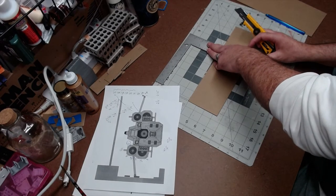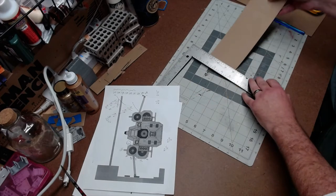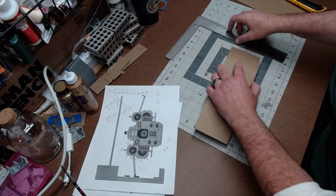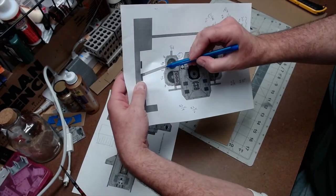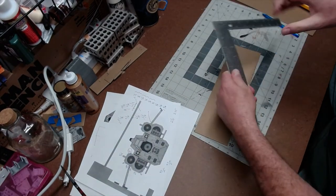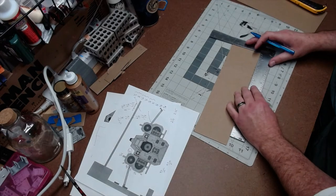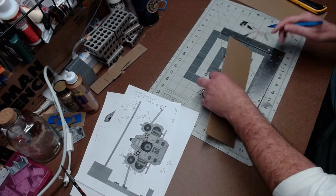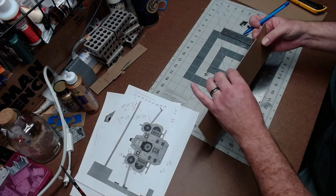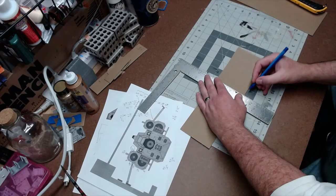Three passes is about all I'm willing to do because I do not want to cut through it. If you do cut through it, not a big deal — you can repair it with a piece of tape on one side. You can see all my cuts and you can start seeing where I'm going with this. Now the next one I'm going in five eighths and then three eighths, but this is an inside corner, so I'll have to score this on the back side. I'll measure that five eighths line and continue these lines on the back side so I can see them, then score there.